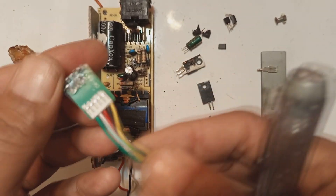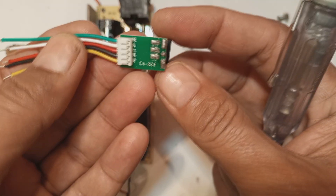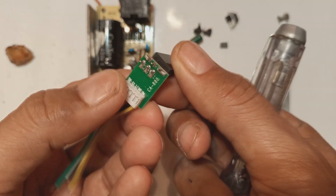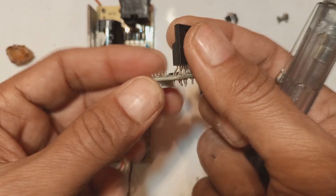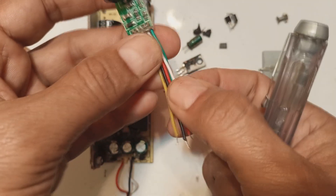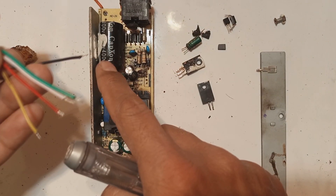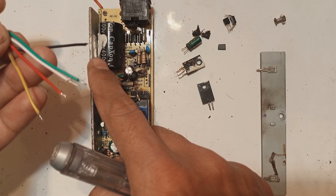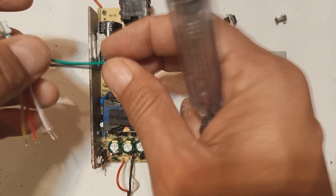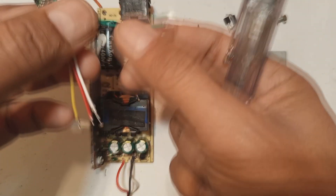For this power supply repair, we adapted this add-on module — the CX888 or CA888 module. This is a MOSFET-type module; the MOSFET is inside the STR IC along with associated components, making a complete power supply solution. The black wire will go to the 400-volt capacitor — which contains 300 volts in our case — as the negative. The green wire will be the positive for that capacitor, so 300 volts will be applied between green (positive) and black (negative).